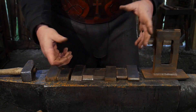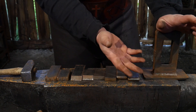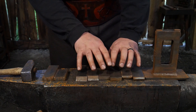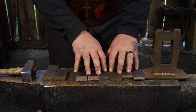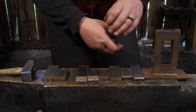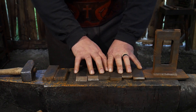Most guillotine tools are generally used for forging pipe or necking down tenons, because that seems to be the hardest thing. You will by far use all three of these dies at some point in making a tenon — they're all kind of part of it. These are probably the most handy dies that you would want to make in your shop, whether you have a guillotine toolkit already, buy one of ours, or buy from another manufacturer.